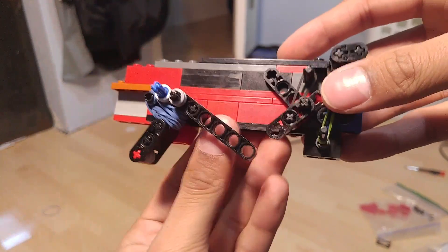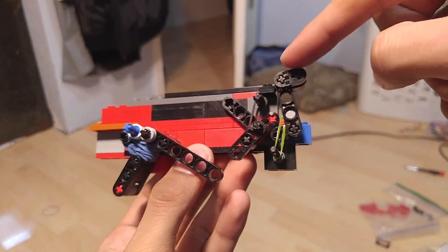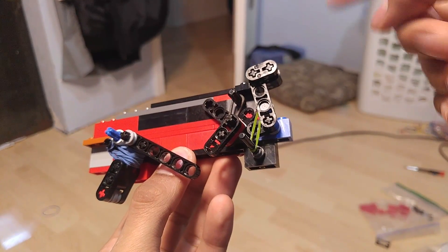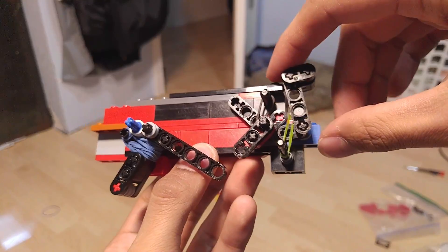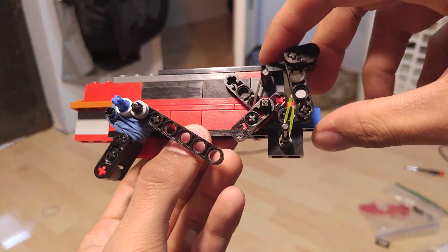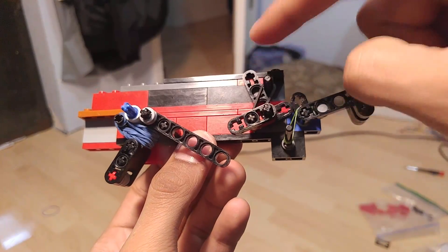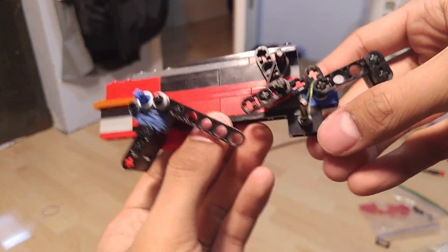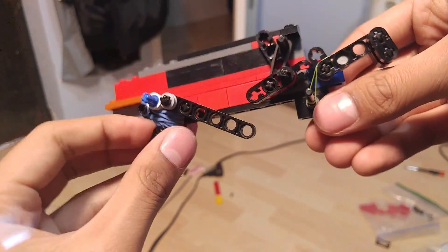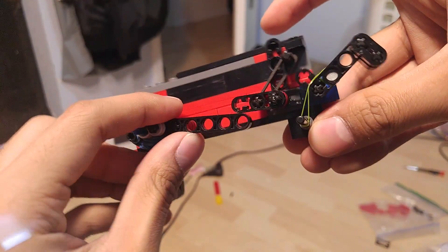So this is stage two — with the hammer. Basically, the hammer is the lock and release mechanism. When you pull back the hammer, you can see it makes the throwback mechanism move. When the hammer is fully pulled back, the throwback can now make contact with the slide, and the trigger can also now make contact with the throwback. It gets a little bit complicated, and now you can see the mechanism working.